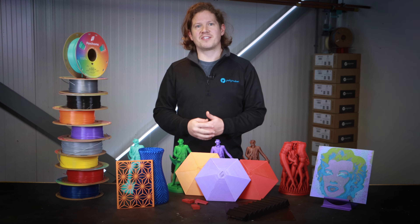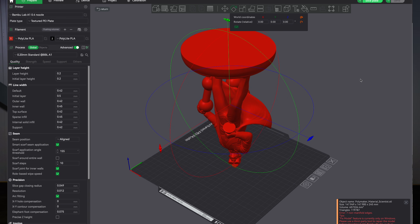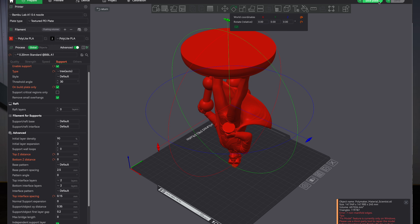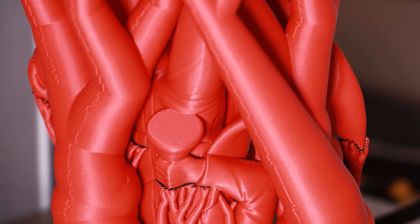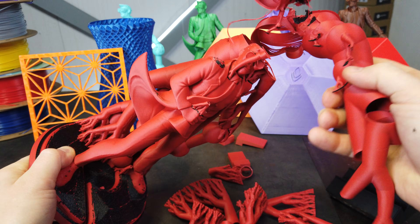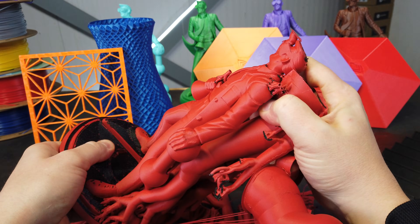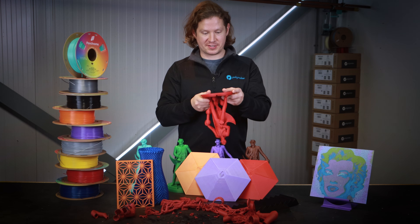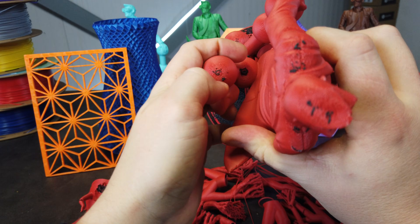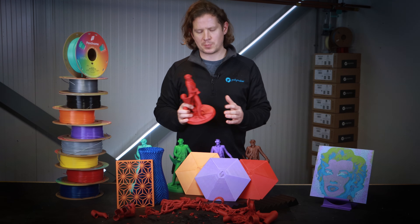As this was a bit of an ideal test with a flat surface on a flat interface layer, I thought I should investigate further and try printing a material scientist using tree supports in a more real-life example. As this model is designed to be printed with no supports, I flipped him upside down and printed the model on the A1 using the same zero-gap settings with the Co-PE as the interface layer. I've just removed all the support from the upside-down Polymaker Scientist — I don't recommend printing it this way, but actually it came off really well. 95% came off really easily.